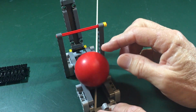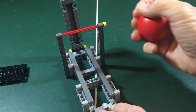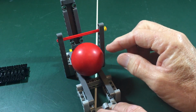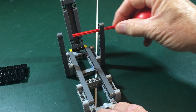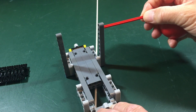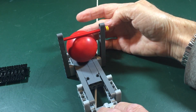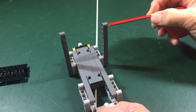The standard size pool ball will happily roll with stability on LEGO bar stock spaced apart by 5 studs. Not only that, but it will neatly pass through bars that are spaced apart by 7 studs. These are convenient numbers for the Technic constructor, as it allows an easy way to build towers and ramps using the basic LEGO rectangular frames and bars to transport the balls safely. While on the track, a ball will pass under a bar 6 studs above the rail. However, on a flat surface, the ball will only pass under a rail 7 studs high.